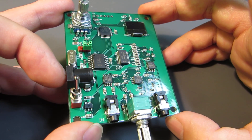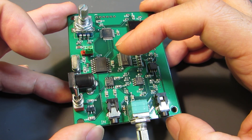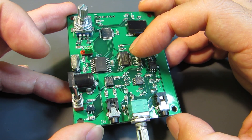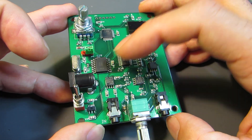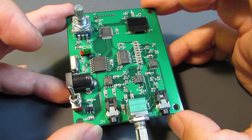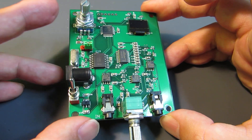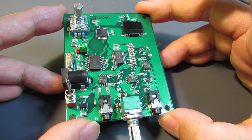The issue is the requirement of 5V DC. The DSP is working at 3.3V but the DA converter works only at around 5V, so we need two kinds of voltage for operation. The requirement of a 5V AC-DC converter is not so handy for portable applications.